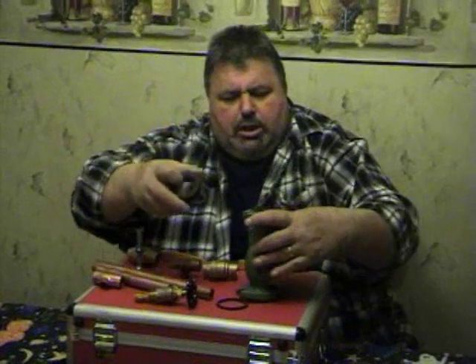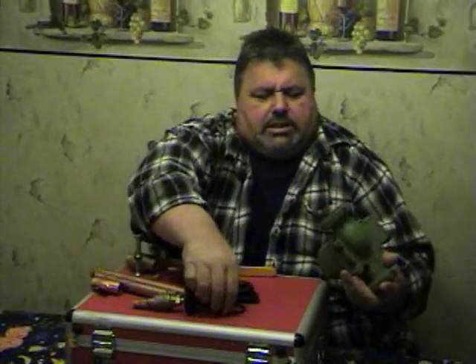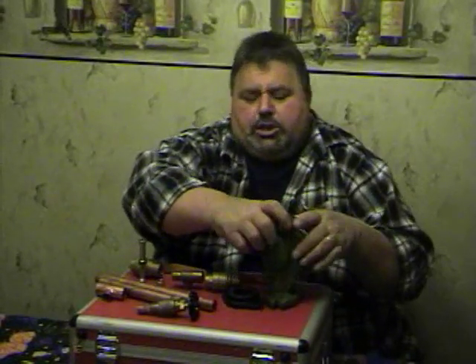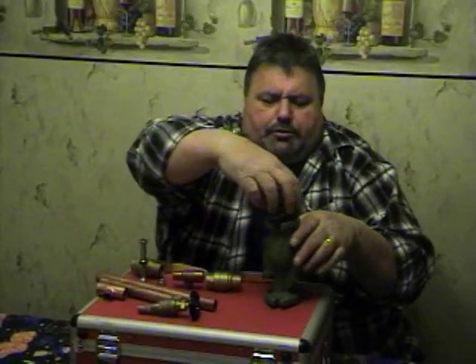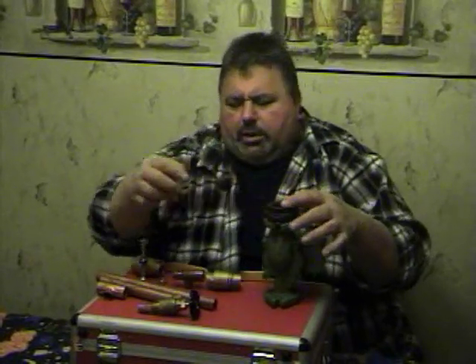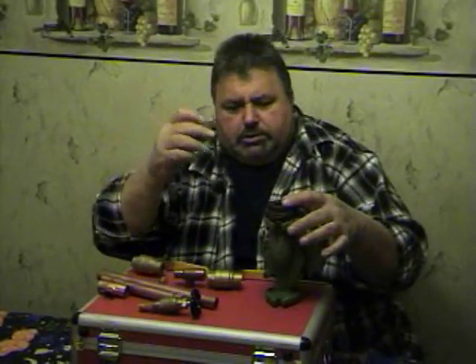This is very easy to change. This is a flange that goes on them — you've got to be sure to specify what kind of circulator you have for the flange that you need. There's a little rubber gasket that goes into the circulator on the top; it fits in and stops any water leakage. The flange goes on top — this is a Taco flange, it fits right on top. You use the circulator bolts, one on each side, and you tighten down evenly so the flange locks down in one spot.